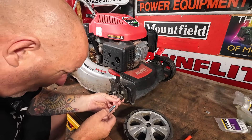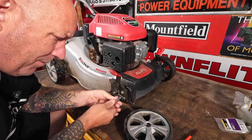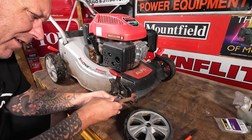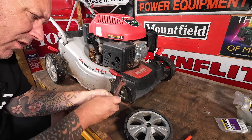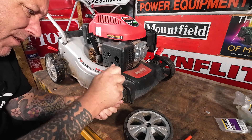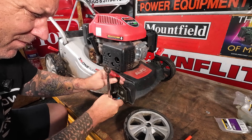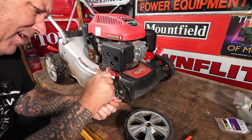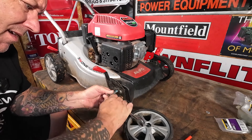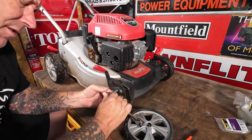I've got my new shoulder bolt and the threads are knackered on here, so I'm just going to try and cut these threads so the bolt will actually go through the arm. Nice and gently — I don't want to cross-thread these. The thread is knackered on the other side so I might have to drill this out a little tiny bit just to tidy it up. Just to get a bite, just to take it in. Once it starts to get it, we should be rocking and rolling. It's starting to go now, starting to cut the threads in. It may pay to buy more than what you need of these shoulder bolts.